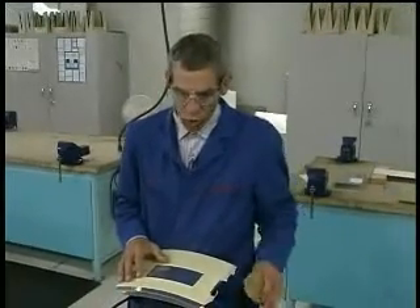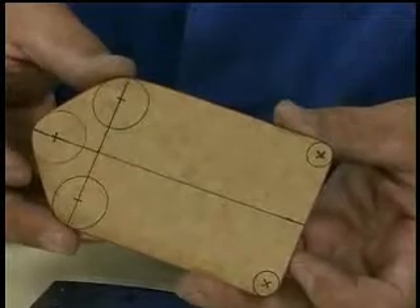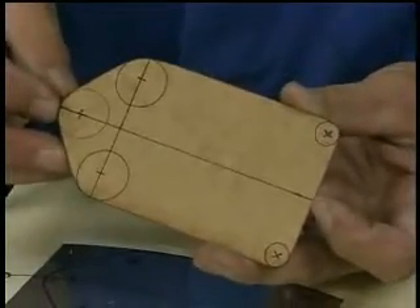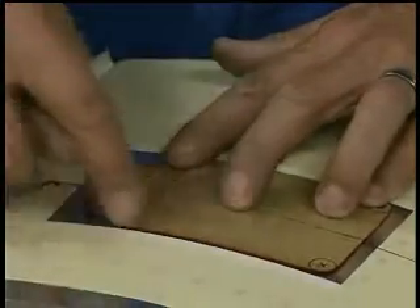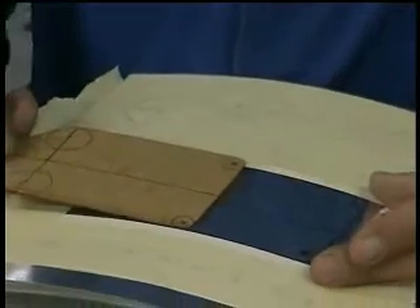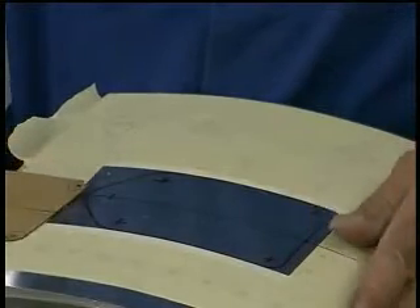I've done a layout of the hole that I want to cut onto some light cardboard paper, and you could even make this out of your piece of aluminum as a pattern to follow. I've placed a center line down the center of this little door cut out, located a center line on my airfoil skin, laid it on top, and traced around it with a red crayon permanent felt marker onto the actual skin. It's a good idea to surround the area with skin protection — like a surgeon — using a combination of one inch and two inch masking tape.